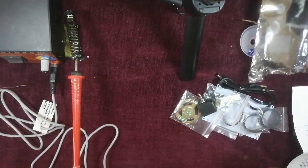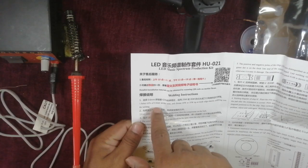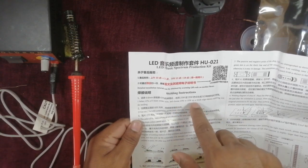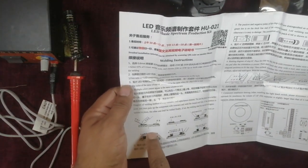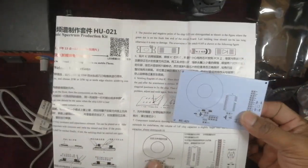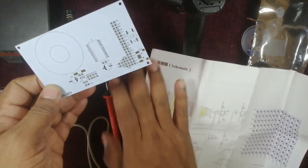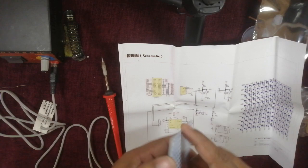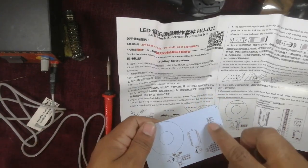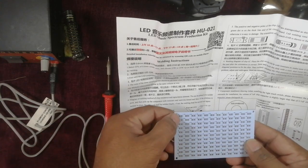In the instruction set they have strictly mentioned that you are supposed to use a soldering wire which should be 0.6mm, and choose a soldering iron up to 25 to 35 watts with a knife-edge tip. They have given a beautiful example of how to solder an SMD LED, including PCB tracing and component numbering. According to the numbers, we solder all the components. On the back side there is a schematic. You should be very good at soldering skills. First, go through LED placement, then all the small components, and at last the integrated circuit.